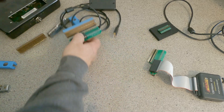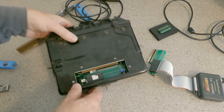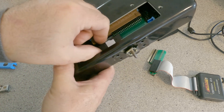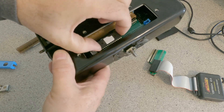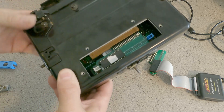What's nice about the zip socket is you just leave this adapter in there, then you just reach in and throw that little lever. It can be a little bit difficult with fat thumbs — you might have to use a screwdriver. Instead of removing the whole board, you just do that, burn another chip, put it in, lock it in place, and you're set.